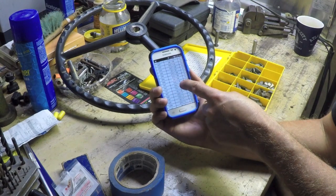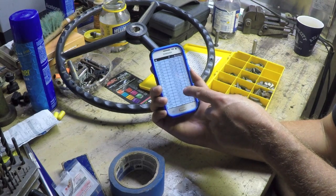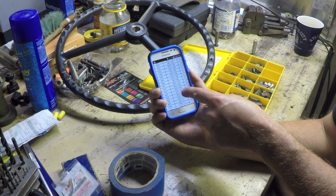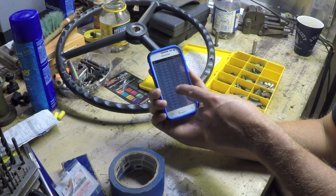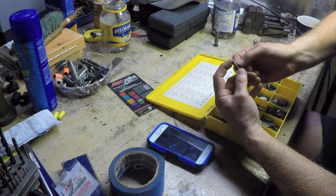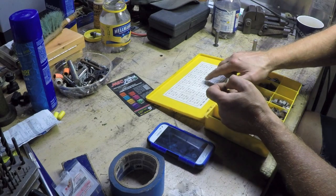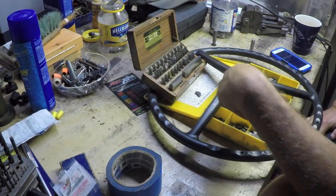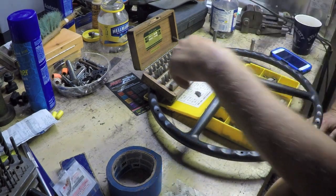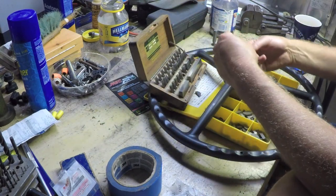However, it turns out if you go up any larger than 3/4 inch, interestingly enough, there is an extra size in there. It goes 5/32, 3/16, 7/32, 1/4 inch. So 7/32 is between the two. It's a number 707 if it's 7/8, which is apparently the smallest. So 7/8 width, so a key this length, but 7/32 thick. 7/32 is just a hair over 218 thousandths, about 218 and a half thousandths. So if I take a 200 thousandths gauge block, will it fit in there?